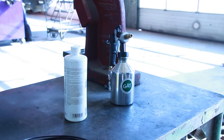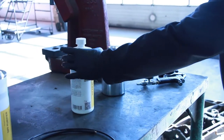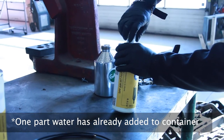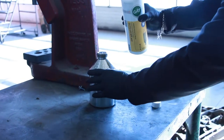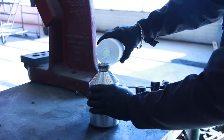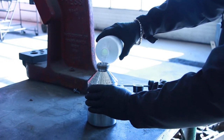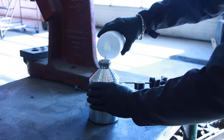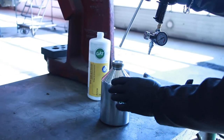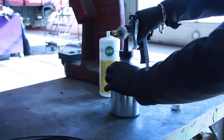So now we're going to prepare the cleaning solution for the gun for the DPF cleaning. We're going to take the air jet fluid — it's a foaming product — and mix it one-to-one with water. This is a biodegradable product, very safe and very gentle on any sensor, DPF, and SCR system. If your soot load is 50% or less, a two-to-one ratio is sufficient; if your soot load is 50% or higher, you should be going to a one-to-one ratio.